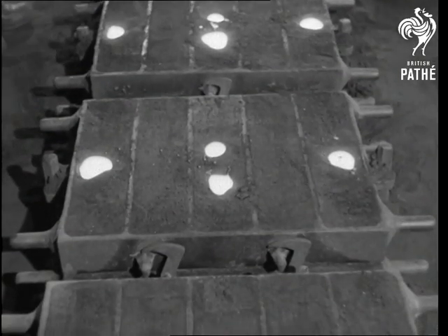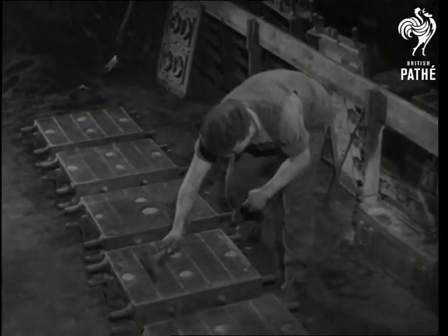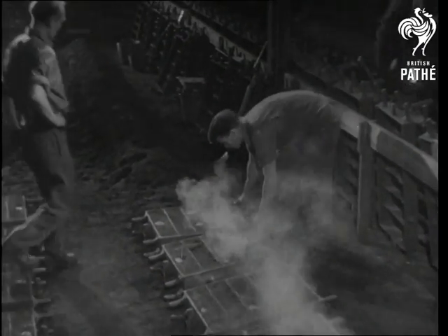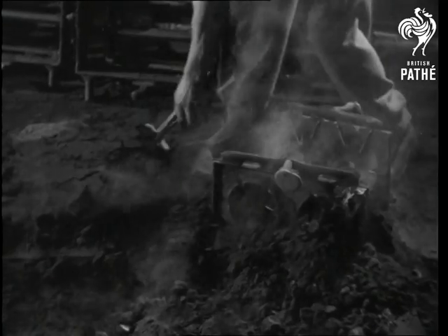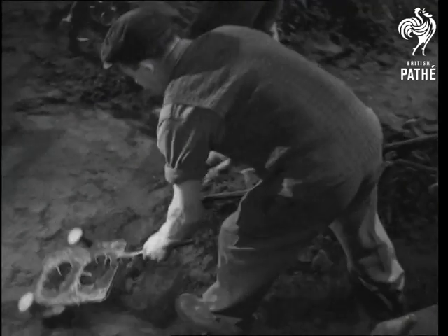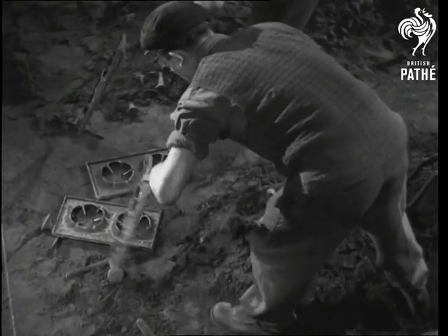Now, while we watch for a few minutes, the metal changes. From a liquid, brilliantly white-hot, it becomes a solid, dull and grey. But it is not cool yet, so in opening the boxes the man takes care not to touch the castings. The two halves of the box are removed, and here in each black and steaming heap of sand are two newly made cooker plates. The metal that set in the holes is still part of these castings — it must be removed. Quite an easy job, because the iron joining it to the plate is very thin. Notice that he knocks inwards each time to prevent damage to the plate itself. Cast iron is brittle. Later, the parts knocked off will be used for scrap and remelted in the furnace.